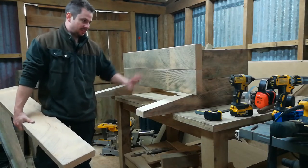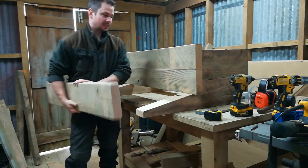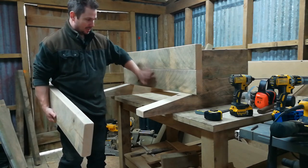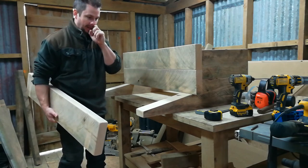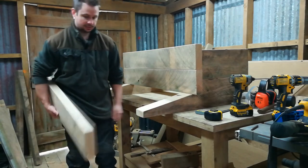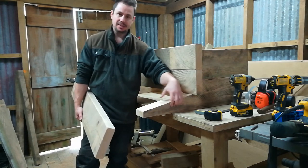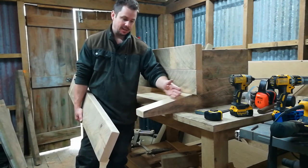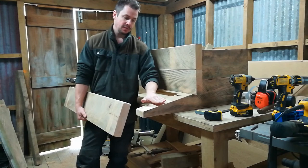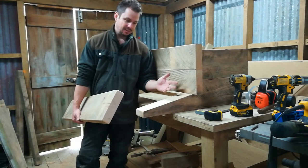So I've discovered that with this thick, chunky backrest that goes on here, it's so thick that it actually takes up quite a bit of seat room. So your butt is quite forward and your legs are hanging off. I want to get it so our butt can be as far back as possible. But I've already shaped these and I don't want to make it thinner by shaping it down at an angle. So my idea, which I'm a little bit scared about, is to recess this board about three centimeters into this, so only two centimeters of the board will be proud on top. It's a bit uncomfortable with the thickness pushing you forward, so I want it to look nice but also be comfortable.